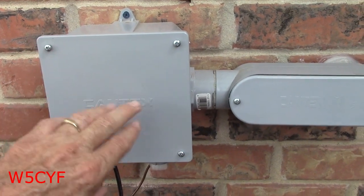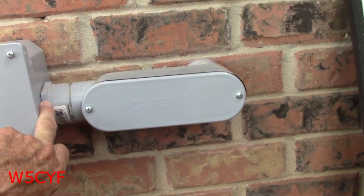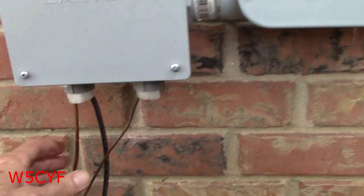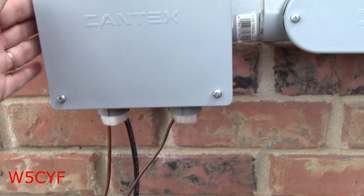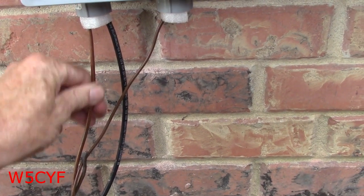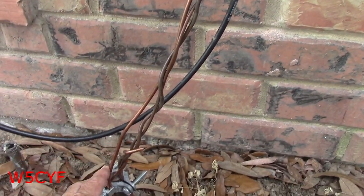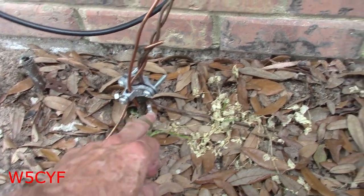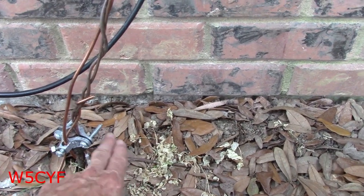This is a six-by-six box and it's just empty on the inside when you buy it — you have to drill your holes in. I had to mark it out and drill it with a regular hole saw. This piece right here is just a junction box made for where you make a right angle. Down here is where the antenna and the grounds are. I had to drill these two holes right here at the bottom; the box itself has no holes at all in it. Down here you can see the ground wire — this is the ground wire from the lightning arrester. This wire right here is grounding the station equipment inside, running down to a ground rod. This right here is the ground coming in from the base of the antenna, and this ground is running up to the service entrance, which is about 10 feet to the right of this pole.